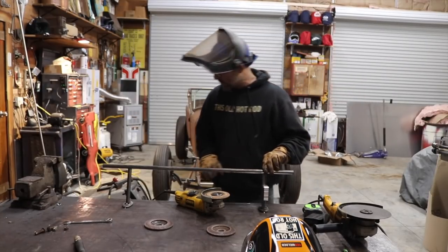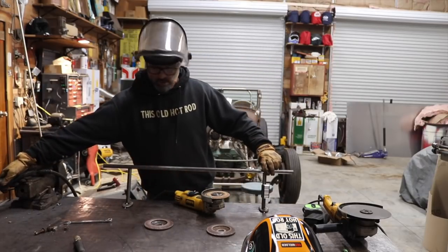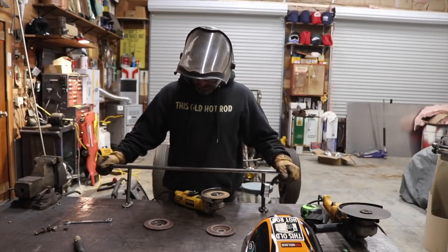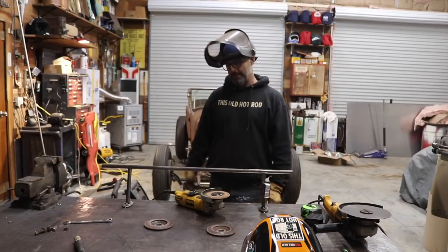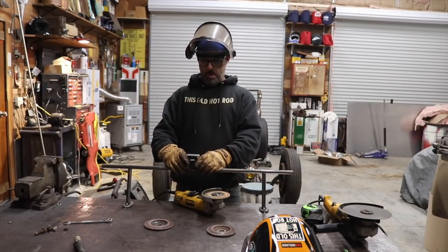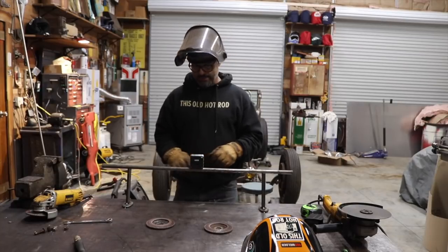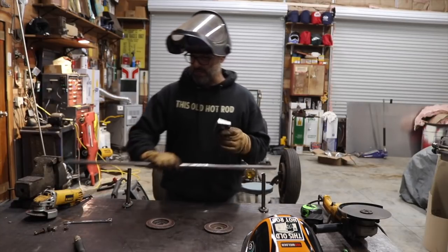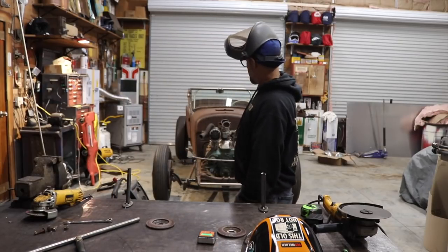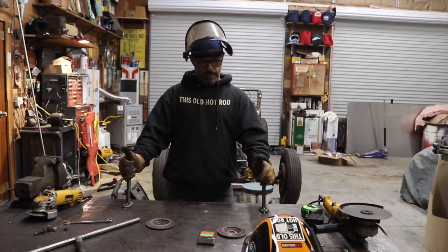It's going to be a good day! I'm even on both sides — let me see if this is level. Whoa, 0.2 degrees — good enough. It's going to change when I weld it anyway. Now I need to get that piece taken off the uprights, brought over here, centered, and get it tack welded in place.